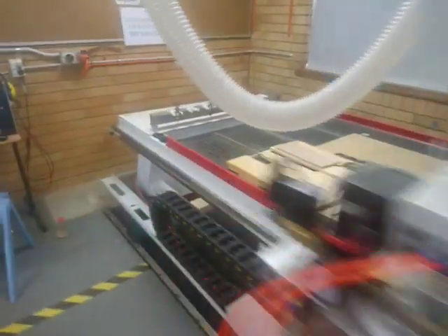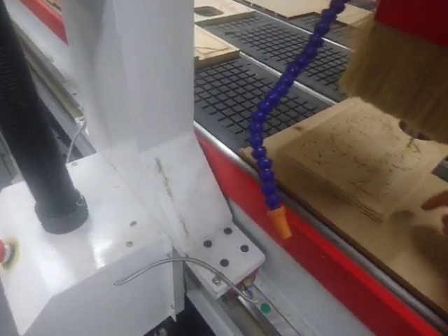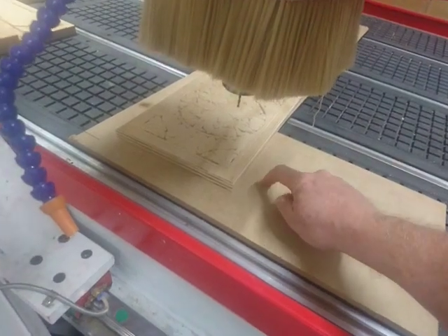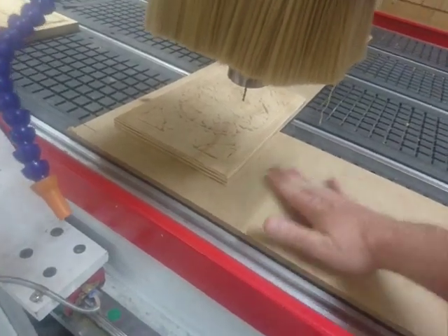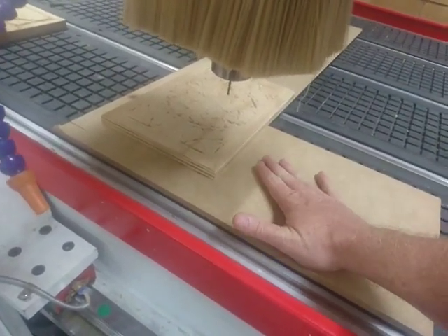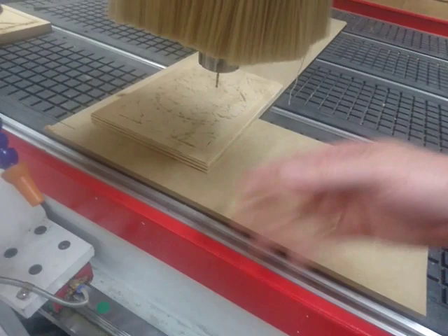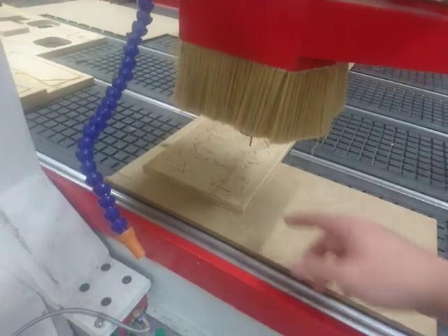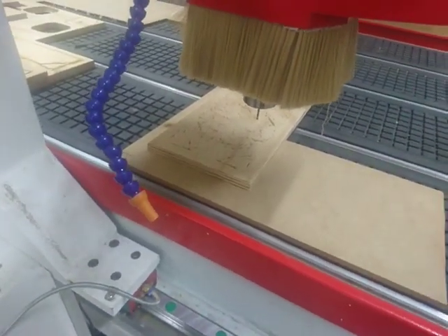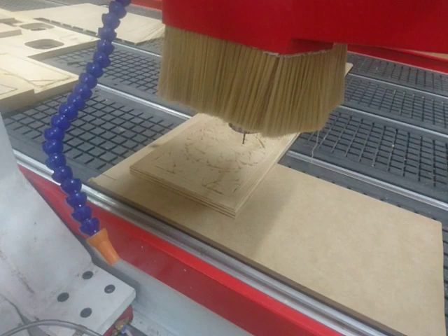Just to rehash that: if we're going to do a job, we're going to suck the MDF down through the vacuum. Whenever we do our Aspire work to generate the G code, we're going to make sure we're using the table surface as our zero. You enter in the details in the Aspire software about the thickness of the material and it's all calculated for you. There's no more setting up in the machine except for the next step where we find the corner or the center point of our job — and that's for the next video.